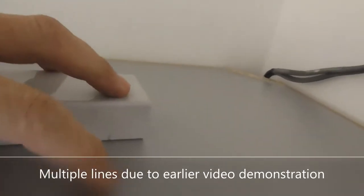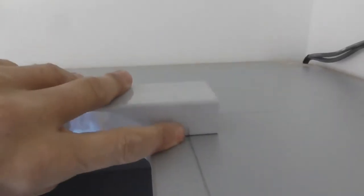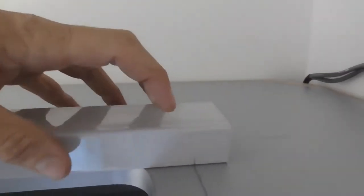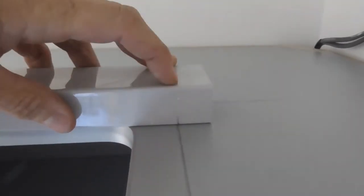So I've just got another little tip here. I know that this mark we've got on here is the backside of the mitre, but when we put our timber on, in this instance, I'm not measuring, I'm actually putting the pelmet on it, and I'm going to physically mark it. So rather than me having to crane around the back to put the mark on the back, this is the back mark, so I've just marked it on the front here. Then when I take it to the saw, I'll put a square cut through here, and then I know that is the back edge of the cut, and then I'll just mitre from that point. It just makes it a bit easier than straining over the back. And it's super accurate, and measuring's great, but this is absolutely accurate because we're transferring the mark from the actual carcass onto the pelmet.